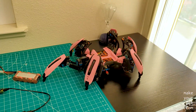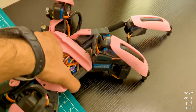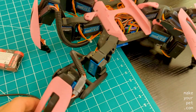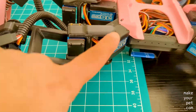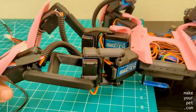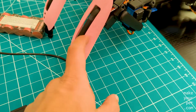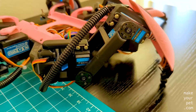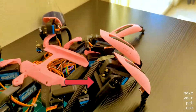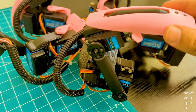So I printed new parts for my main hexapod with the same ideas, and I really like the results. I swapped the parts on one of the legs to show you. I printed a new femur and a new coxa, but I'm going to keep the entire old tibia. Especially I like the new femur, which supports both servos from both sides and has a bar in the middle to connect the sides together. But I was able to keep the same range of movement.